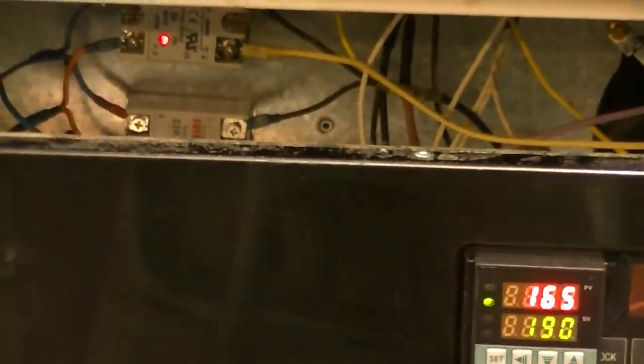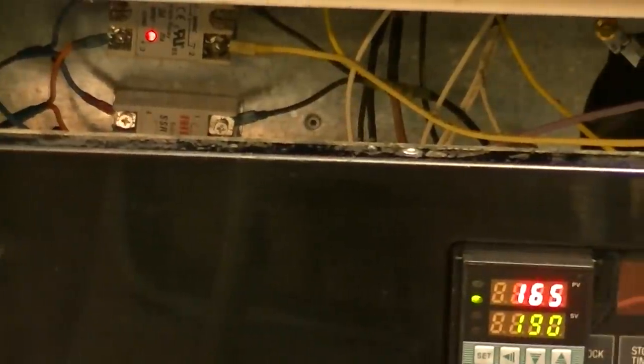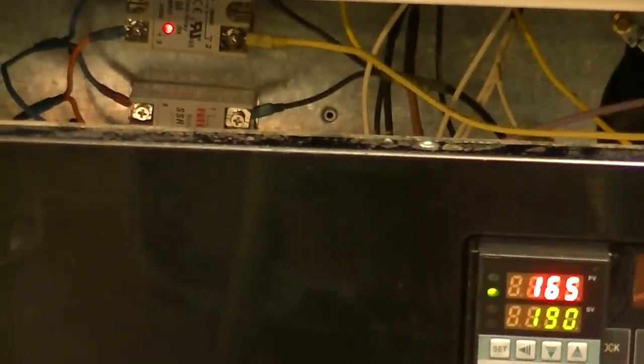This thing's going to have to learn from just heating up and remembering what's going on. It's going to learn that those coils are still hot - there's still a lot of residual heat in there that's causing it to continue to ramp. We may actually see it go past 190 on this time, because this is a learning circuit. It's some pretty intelligent equipment - it's really the way to go if you want precise control.